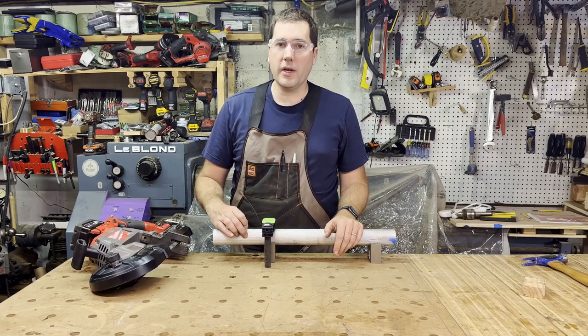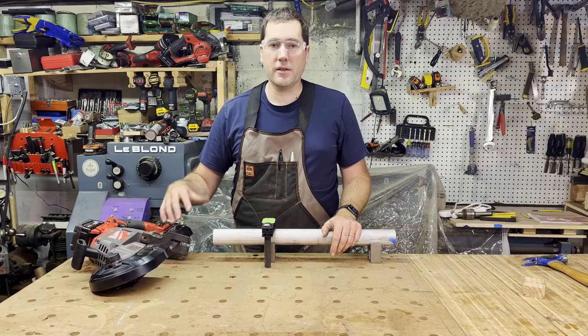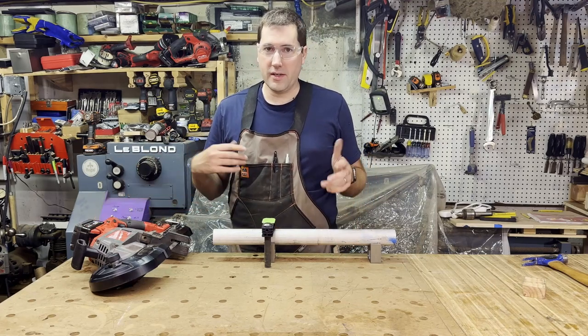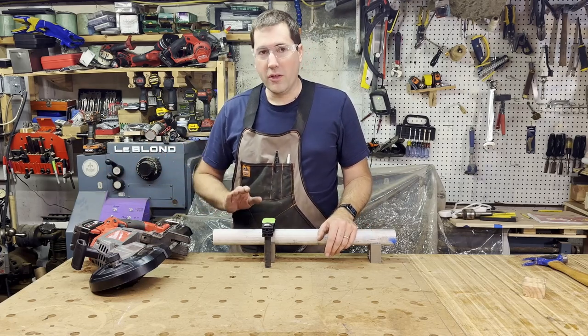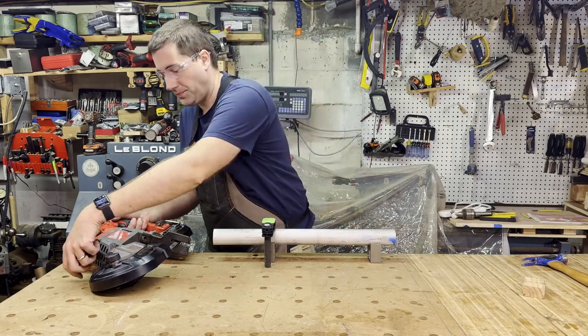So this is a 2-inch diameter piece of, you know, just 6061 aluminum. I've still got the extreme thick metal blade on here. It's an 8/10 tooth blade. That's the same one I was using for the steel tube. I've got it set to the maximum speed of 5. I've had it set for that for all the different cuts that I've made so far here. On the aluminum, like I said, you'd really want something a little bit faster, but that's what it is. So it should work all right without that anyway, though.